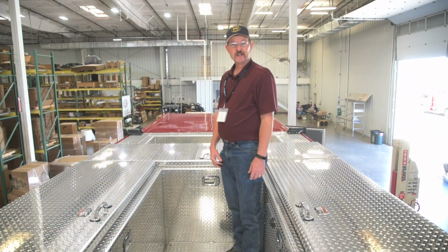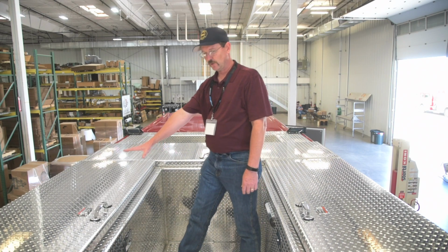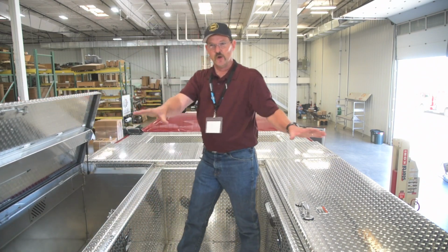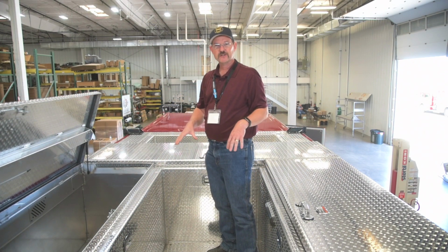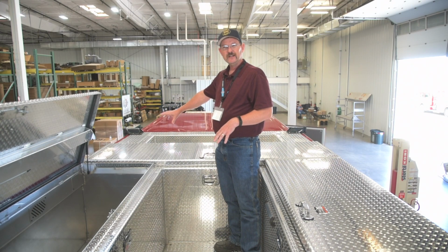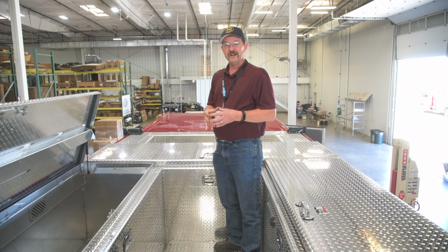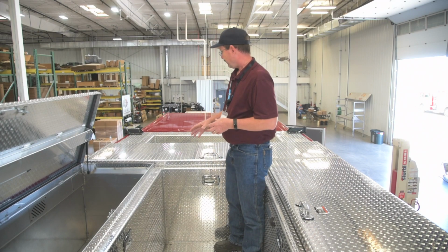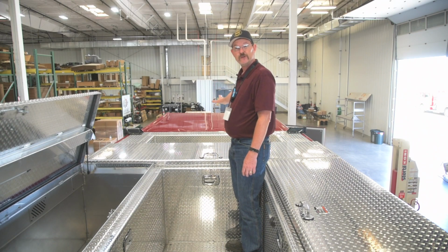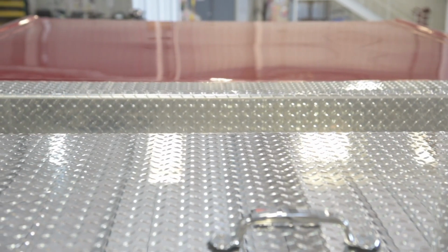So we moved to the top of the truck. Again, lots of storage up here. We were able to put 4 28-inch deep casket tubs on both sides of the truck. When we sat down in pre-construction for this truck, the initial design was to carry them as far forward as we could. We talked about what we are going to store up here, what do we need. So you may not be able to see it in the shot right now, but we put a tub up front for a future add of an LED light tower. That is already pre-wired.